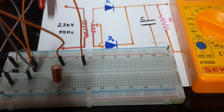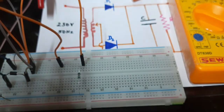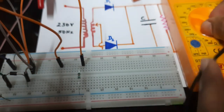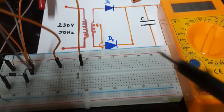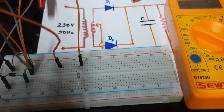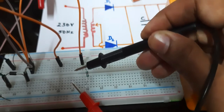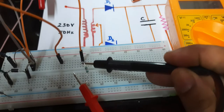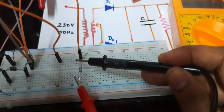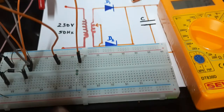This experiment has to be repeated as a second part without the filter. Simply remove the filter capacitor, connect your resistance or resistance box here, and repeat the AC and DC measurements. Measuring the AC value, then switching to DC and measuring the DC voltage — it comes to 2.3 in the multimeter. AC and DC measurements have to be done without the capacitor.